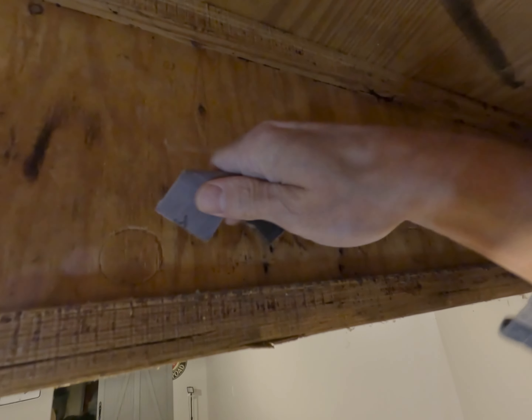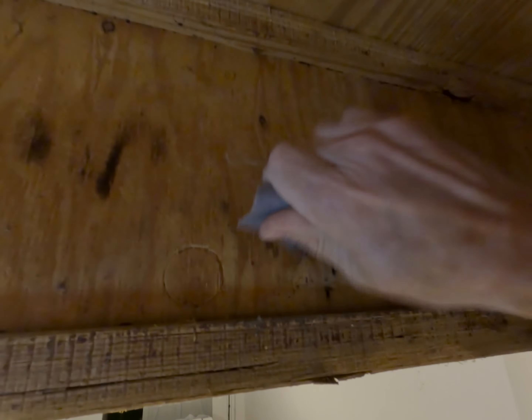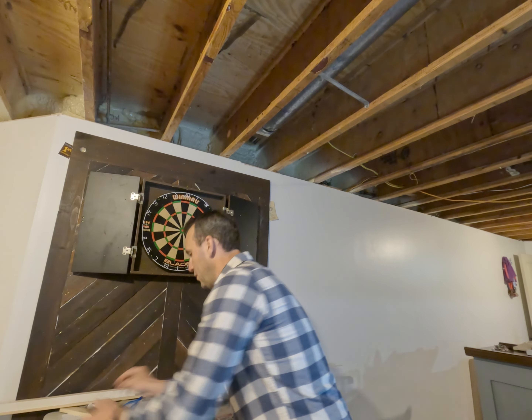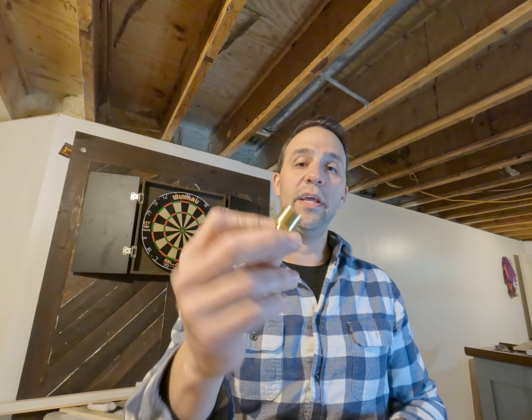Our first step is to clean the copper. I use this sandpaper and we clean it to make it basically brand new. We have our solder — this is just normal solder, you go to Home Depot and buy yourself some. And we have flux — this is very important. It coats everything and makes sure that the solder flows correctly around the pipe. Just like we clean the pipe, we also clean the fitting. They make special tools for this, but you can just use sandpaper. Everything has to be very, very clean — do not skip this step.